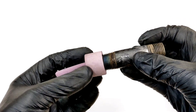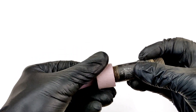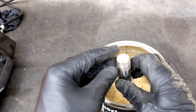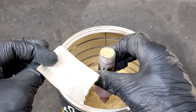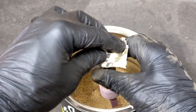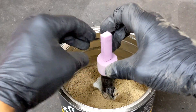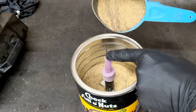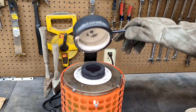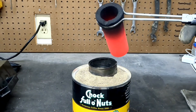So I cut out this piece with my CNC, slightly smaller than the piece of pipe, and I threaded it onto the pipe — this is how I cut the threads into the foam. I filled the pipe with sand and put a piece of tape on the bottom because the pipe is going to be facing down. I need something to hold back the aluminum from flowing down the pipe, because if the pipe was an open cavity, the aluminum would burn the foam but also flow down through the pipe. I'm going to jump right to the metal melting and the cast. The metal is now molten and I'm going to do the second lost foam casting experiment.